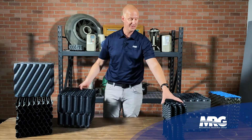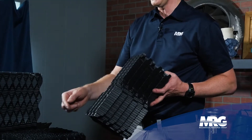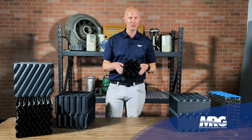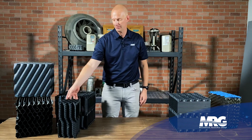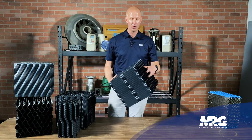Here's another solution — a solid flute all the way down, a little more compact. Each one of these has a different heat transfer rating, so you can talk to your cooling tower service provider, manufacturer's rep, or OEM about all the different fill solutions available.